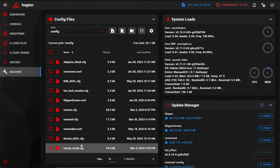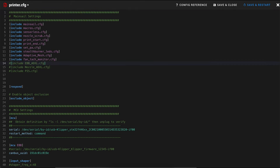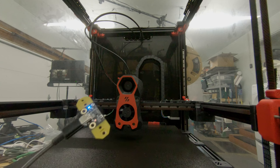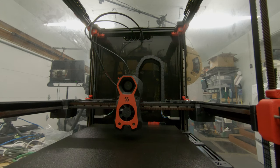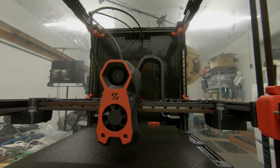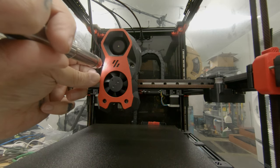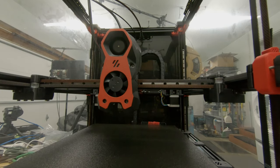I'm going to go into the printer config and comment out the EBB, then do the Portable Input Shaper next. I'll grab it, plug it in, move the printer head, install the Portable Input Shaper, then restart the firmware and rerun the whole process.